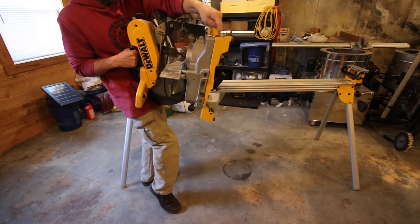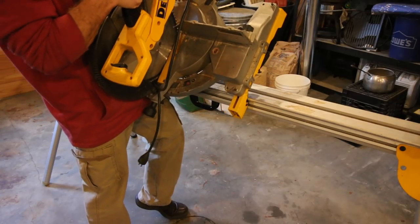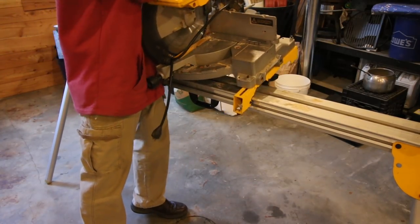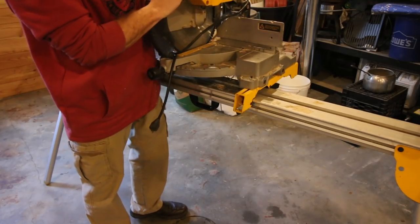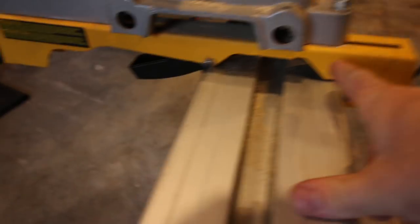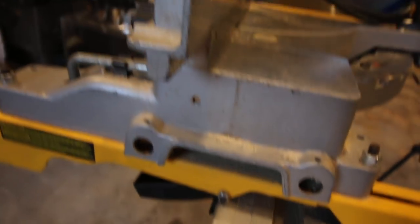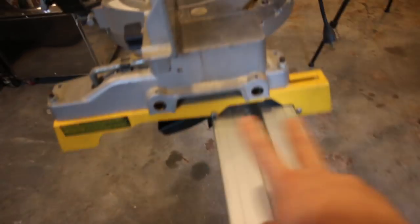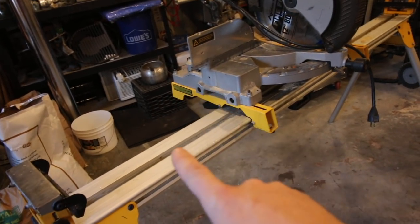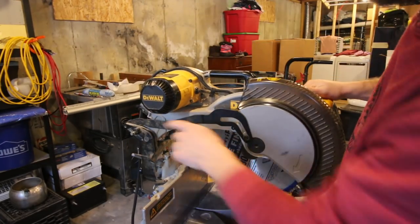You have to get brackets that you put on your chop saw to hold it to the stand. The easiest way I've found is to hold your chop saw, get the front of the feet in place, and then lower the back in until you hear a click. If you don't hear a click, it's not locked in and you need to check your brackets. There's also a plastic handle on the back side — you pull the handles, tip it forward to remove. The brackets are adjustable so the stand fits more than just one saw.